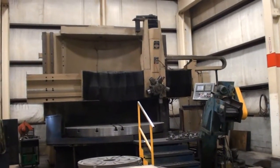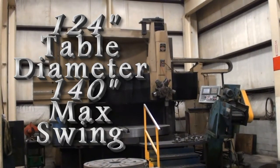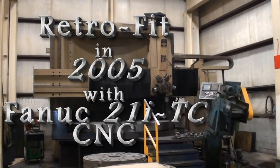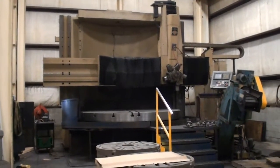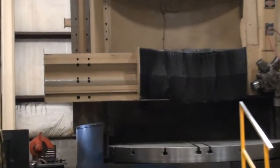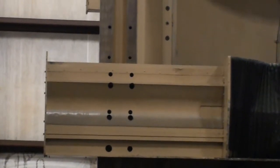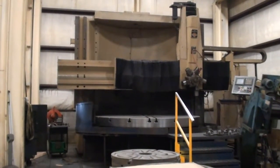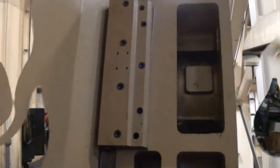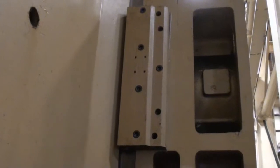We're going to get a real brief look at a 124 inch Bullard retrofit with a Fanuc control. This machine has an elevating rail, but it is of PEG construction, and that means the rail needs to be lifted by crane and then bolted into place in a fixed position. Just showing a close up of the PEG rail system on the Bullard.